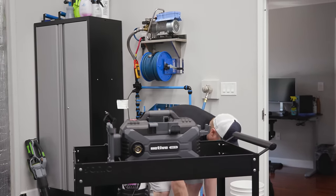Greenworks, go look at the pressure washing chart. Sun Joe, all these things. You can tell every time you turn them on, they sound like they're going to break. And they do 1.2, 1.3, 1.4 gallons per minute. There's a pretty remarkable difference between 1.2 and 2 gallons per minute. It takes a lot of energy, a lot of power, a lot of quality in the pump in order for that to happen. So, orifice matters. Just do what I tell you to do.